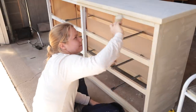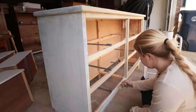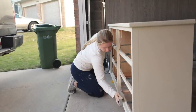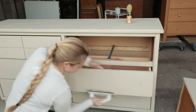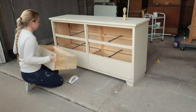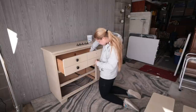This was my first time trying out Jolie paints and I absolutely loved it. I chose the color Farmhouse Beige — it was a bit more tan than I thought, but the paint was simple and easy to apply. I did two coats, sanding lightly in between to smooth out any brush strokes. The Jolie paint was really good at self-leveling, and I did a light distressing around the whole dresser with my hand sander. I used Jolie's clear wax as the top coat to seal the piece.